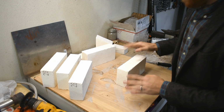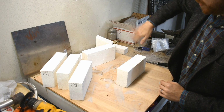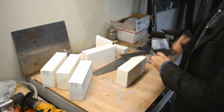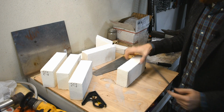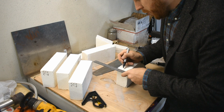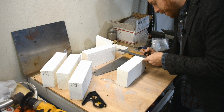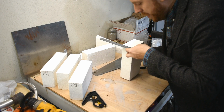Now re-sawing is very tricky because you have this long thing that you've got to cut through. To make it thin, you don't want the saw wandering. You also don't want to cut at an angle all the way across because that just looks dumb. So I'm going to use this again and the combination square. Now these bricks are 9 by 4.5 by 2.5 thickness, and I've seen different thicknesses for these bricks. You can buy these bricks 1.5 inches, 1.25 inches, 2.5, 3 inches. If you start with thinner bricks, then you don't have to re-saw them. Or if you start with a design that doesn't require this, you'll have the same nice benefit. But when have I ever made things easy on myself? I can't remember a time.